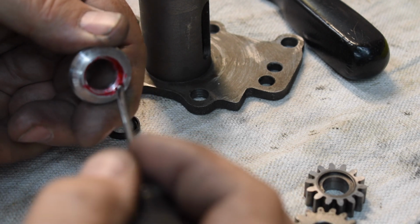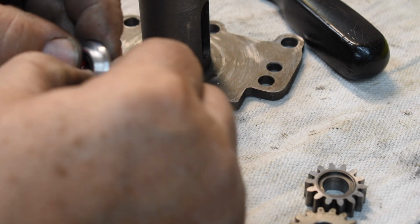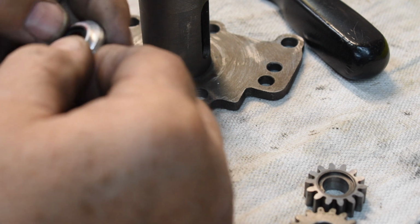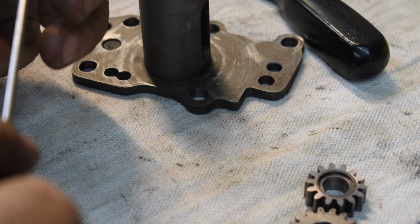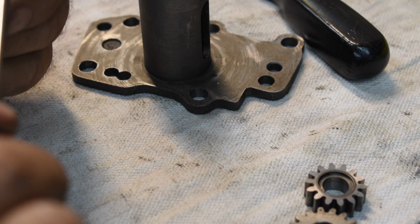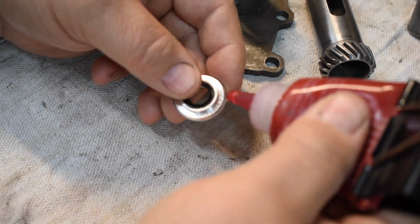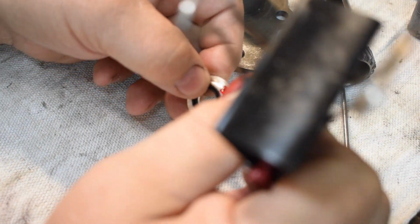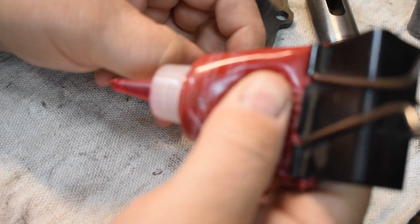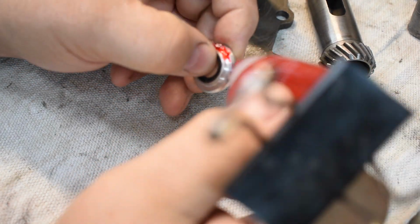Trying to smear it around, as even as I can. We're going to make the open lip side face the oil pump. Let's get the extra out of there. I'm going to goober this up with some Loctite 518. It's probably way more than it needs,